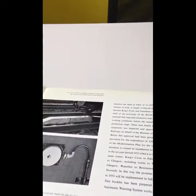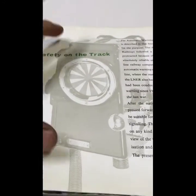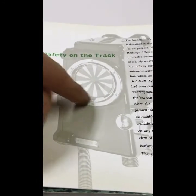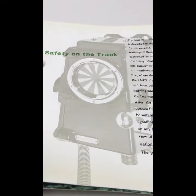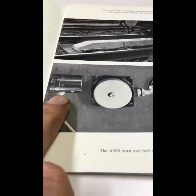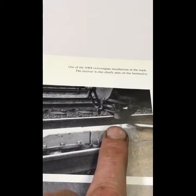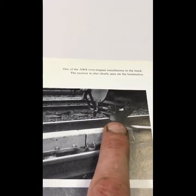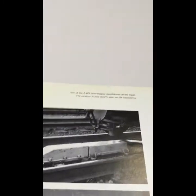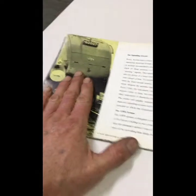If he cancels it within the time, he's on the winner. This is the sunflower on DMUs that I remember as a kid — the sealed unit, you get the sunflower indication. And just mentioning a few other things: there's the bell unit, you get the air horn, and a lovely picture showing you the equipment underneath the train itself for the actual magnetic receiver. So you can see there's a fair gap — it's got to receive that magnetic field across that gap. This booklet was designed to show drivers how it works.